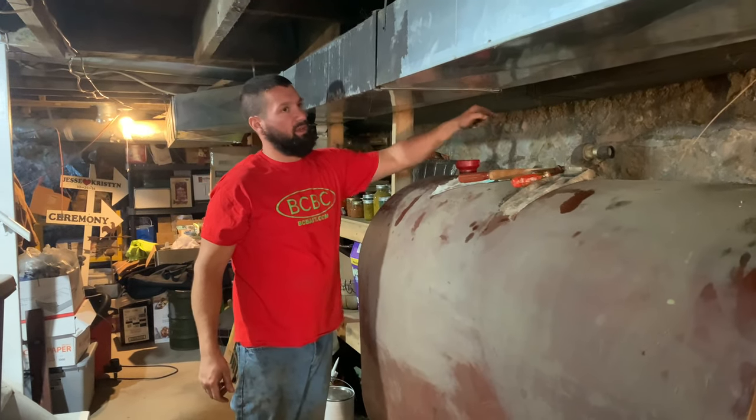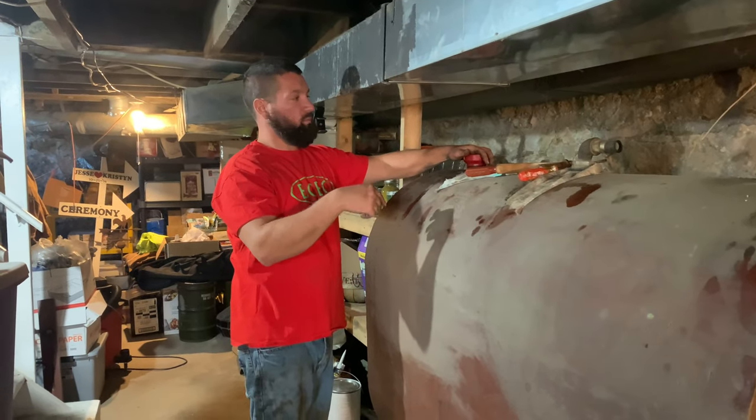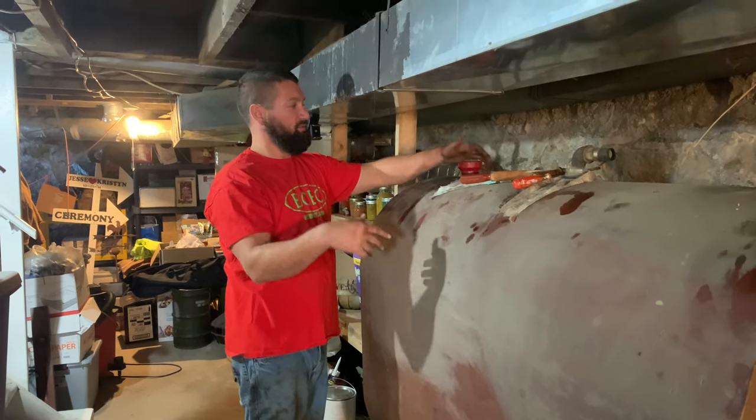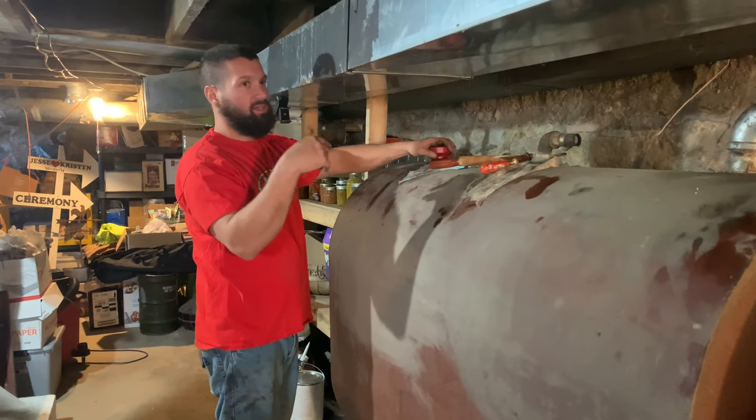This is part of your vent now, and it'll go out the wall. As the oil man is filling the tank, it's going to whistle, and then it'll shut off when it's done filling, the 20, 30 minutes, however long it takes. So you'll hear the whistle, then it'll fade for the fuel man on that.